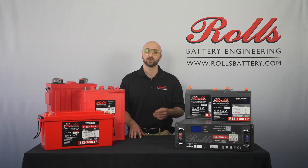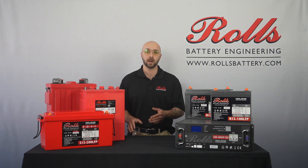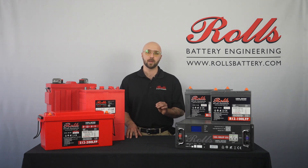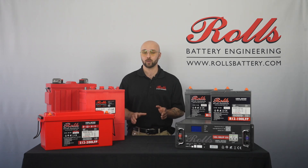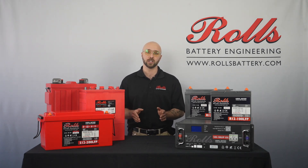If current is the culprit, try charging it. If temperature is suspect, adjust the temperature of the battery pack externally, or using an S-Series LFP device, use the internal heating by applying a charge voltage, or consider insulation changes to your battery box. For more information on what specific condition has caused the BMS to enter protection mode, connect to your battery over Bluetooth and refer to the Rolls LFP Connect mobile app, or with S-Series devices, use the screen and refer to the manual to find the specific error code relevant to your disconnection event.